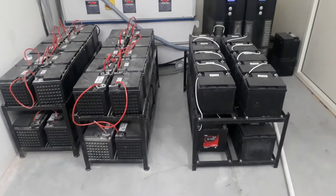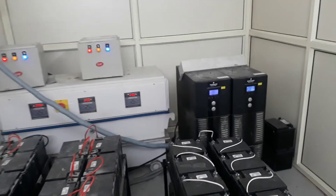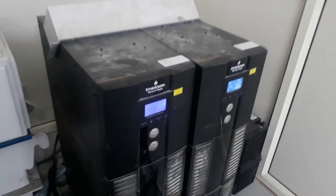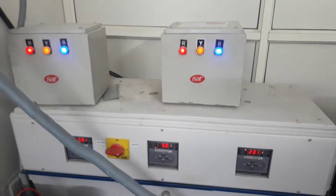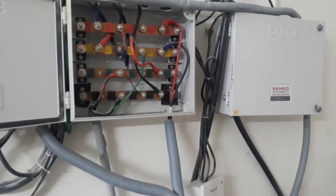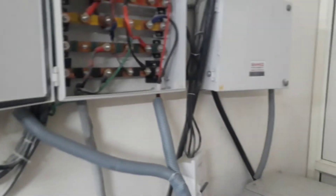Now this is our site and here we have two UPS of 20 KVA each and their battery banks are also attached with them — these UPS are single phase. These are the UPS, and this is a servo stabilizer being used to stabilize the voltage. These boxes are phase sequence correctors. In a walkthrough audit we found that the load of this site has increased and this complete mess of cables needs to be corrected.